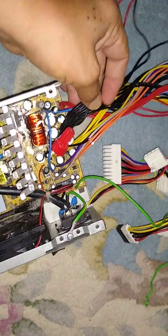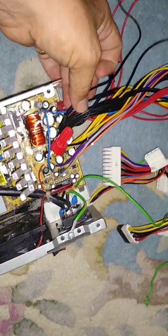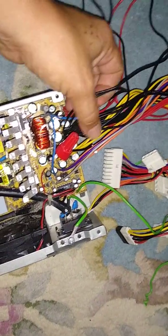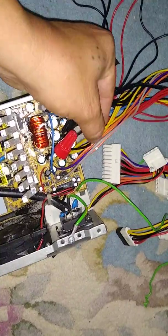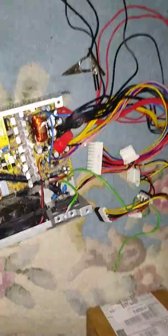So that's pretty much it. Take two of these yellow 12-volt wires and two of the black ground wires. The black goes to the black wire on your pump and the yellow goes to the red wire on your pump. That's it — very simple. If you have any trouble, let me know and I'll try to explain better or give you a better example.